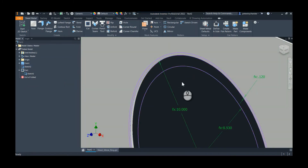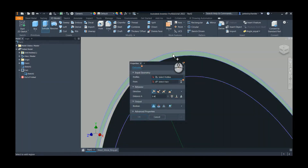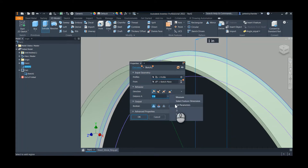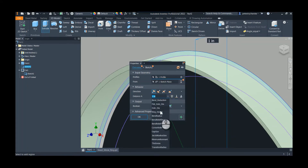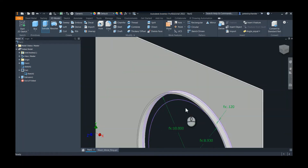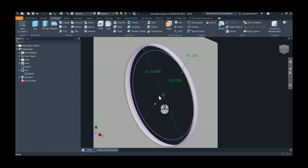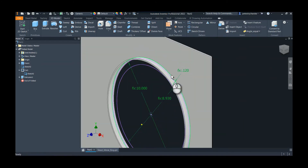It's a relatively simple feature — we're going to cut out both of these, hit okay, and we'll have to share the sketch which is fine. Then we're going to use a standard extrude to create this shape. I just want this ring, and instead of one inch tall we can come over here — that's going to be our ring height. I'm measuring that from the top surface, so if you're measuring differently you'd have to take into account the plate thickness. I'm not going to add fillets — if you want to know why, take a look at my Autodesk University class on iFeatures linked in the description below.